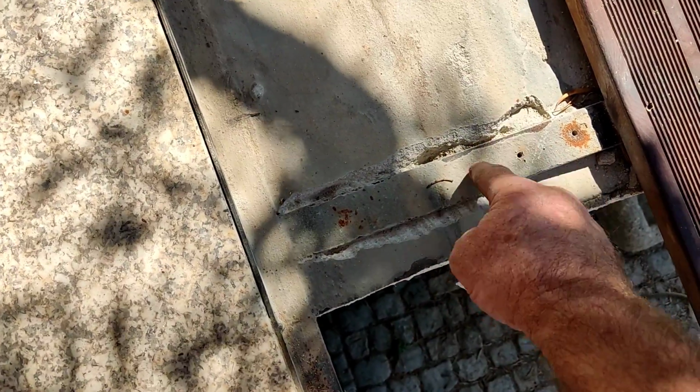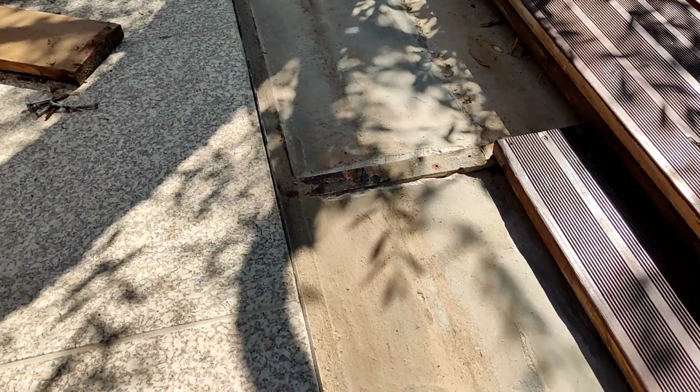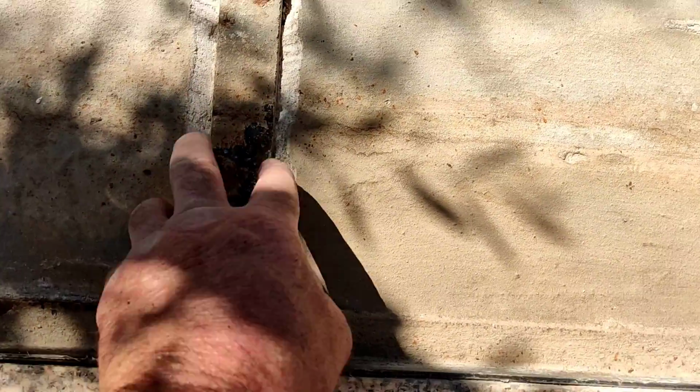this is the structure of this balcony, either side of this had a crack along there and there, and I'll see someone's been here and tried to seal it anyway with some form of product, as you can see. But you see these two aren't cracked either side, but these two had big cracks either side, which could let water in, which doesn't help.